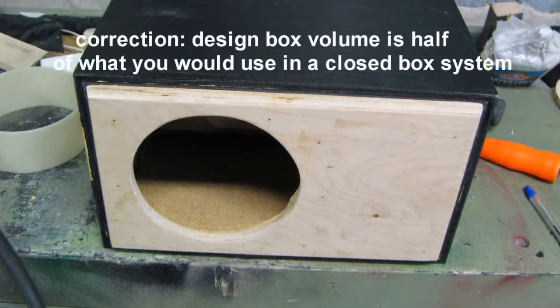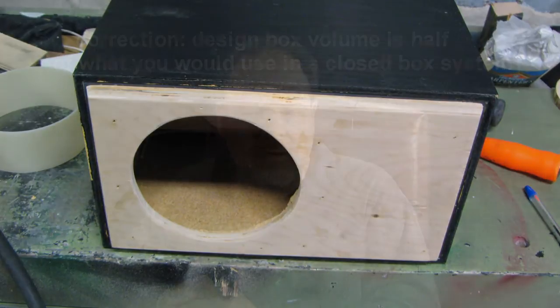I've done a lot of experimentation with this system and the sound is really amazing. Even if you use an inexpensive speaker, the brand doesn't really matter. The key of the system is you design your box volume for a closed box design, and the natural resonance of the speaker — if the speaker goes down to 50 Hz — will achieve that half power point at 50 Hz if you design the isobaric correctly.